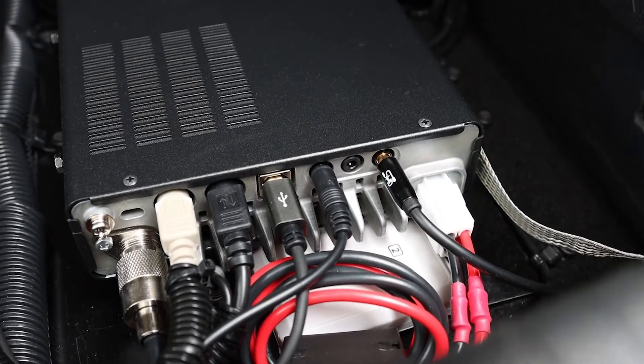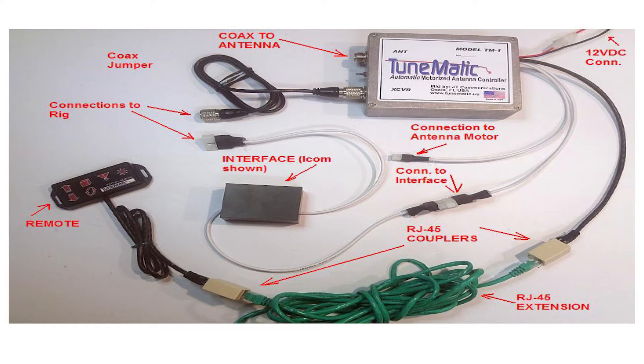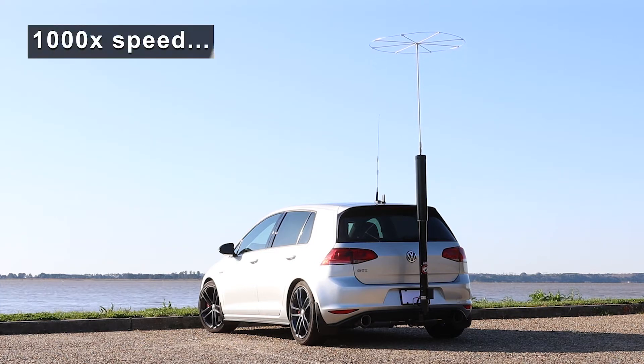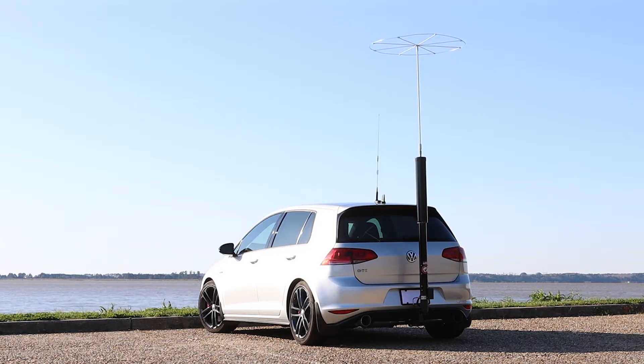For the most part, the installation is pretty simplified — it's almost plug-and-play. If you've got something other than the Tar Heel, since it comes pre-configured for the Tar Heel, you will have to do some configuring, and I had to do some. When you initialize the antenna, the TuneMatic needs to find the top, so it immediately runs it to its upper limit, then brings it back down to its lower limit, then raises it up just a turn and a half or two turns. That's how it establishes its park location, so it never drives into the lower limit again.